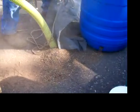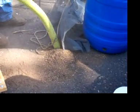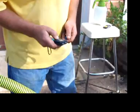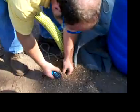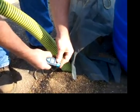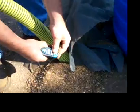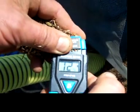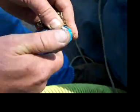Here's a little bit about what we're making — that's our material. We can check the moisture content now. We want it to be between 10 and 15 percent. We're at 12 — that's very nice. So we'll be using about 12 percent moisture; that should make nice pellets.